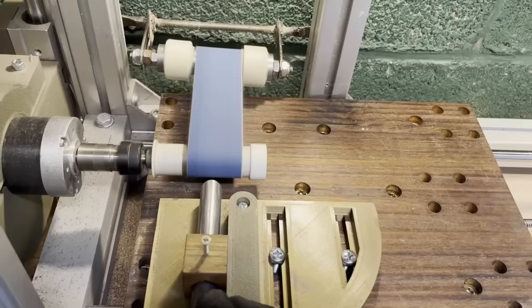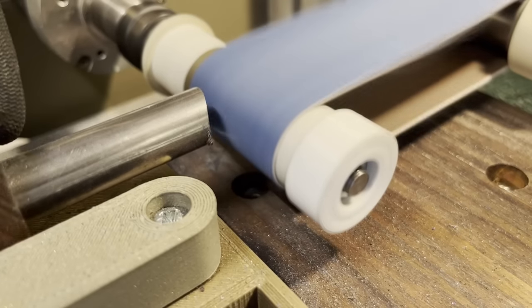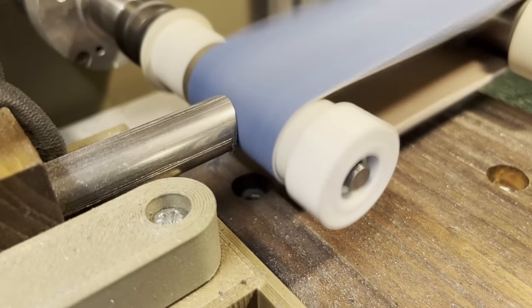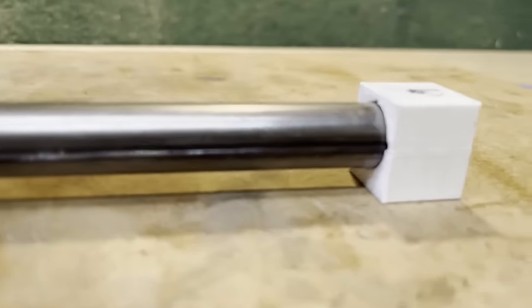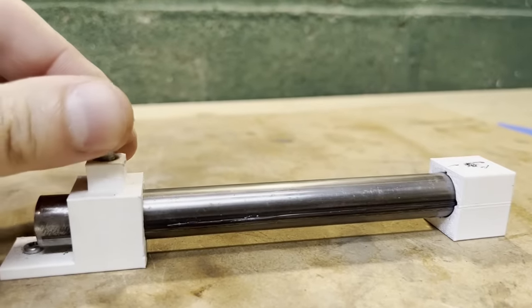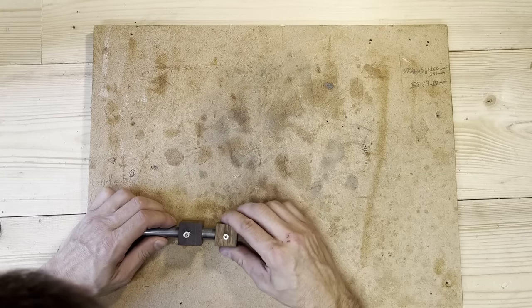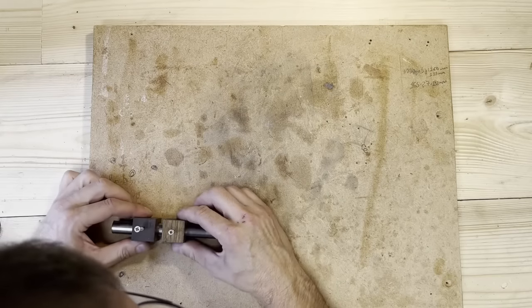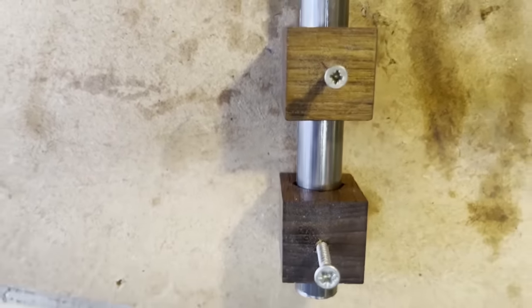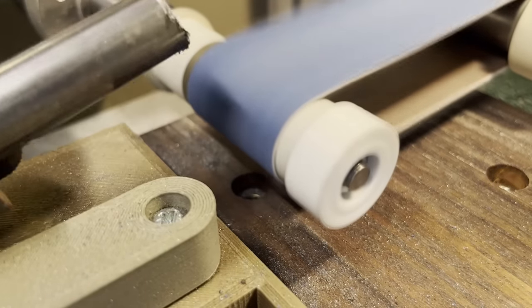Yeah, pretty good fit. So it's kind of my notching lathe that I made, and as you can see there, I mark the sides, so to square the tubes, I'm making a 25mm notch on a 15mm tube. And this is just to show you the jigs that I 3D printed to mark the tubes. And then I make these bits out of wood to hold the tube in place when I'm notching it, because it gets hot, and the 3D printed part would just melt if I would do this with a 3D printed part.